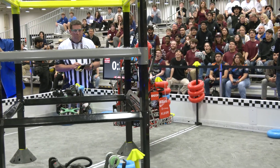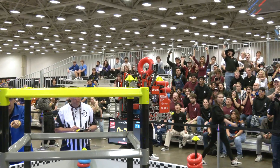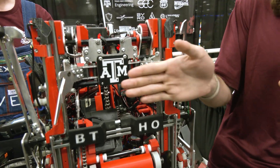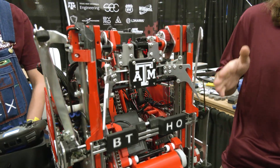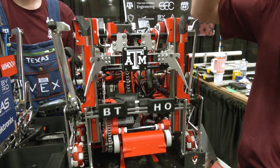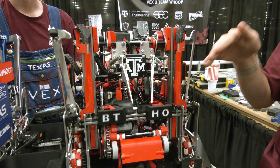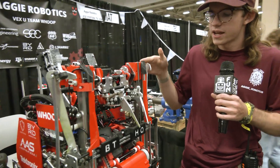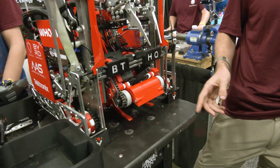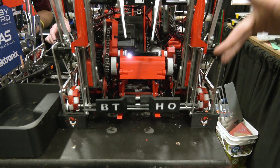Let's pass over to Justin and talk about the lift system on the robot. Talk to me about what the lift system means to you and how it got integrated. Ever since the start of the competition, we were really focusing on our Tier 3 climb. We started with our inside hooks, and these have fingers right here which allow — if our robot tilts back because we're cantilevered on the corner — we reach out even further and can hook on. This goes into our outside hooks, which hook on once we are raised up. These are static, directly connected to our chassis, which means that once we are hooked on, our robot cannot come off.